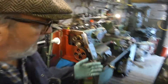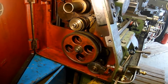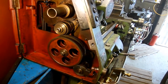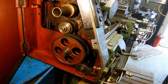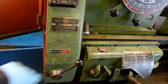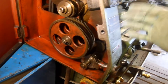Here's the lathe. You can see I've got the door open at this end, and what you can see there are two large gears. This is very clever - it has a 125-tooth and a 127-tooth gear keyed together on the same shaft. The idea is that gives the conversion between metric and English. When you move this lever it goes between the two - you can select from one to the other.